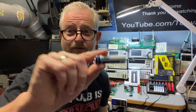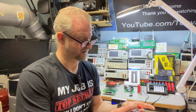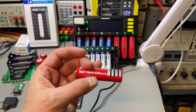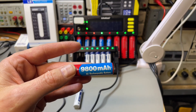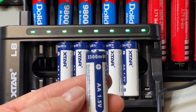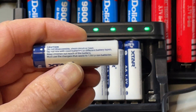I have presumably the worst batteries available — the Dolly Dada. I'm not sure you can even buy them still because it was a big scam. And I have some proper ones that were sent to me by X-Star. These are 3300 milliwatt hours instead of milliamp hours, so we need to see why that is. For the testing, I also have lithium ion 3.7V 4200 milliamp hours, the Dolly Dada alkaline batteries claiming almost 10,000 milliamp hours, and then the X-Stars with more realistic values — but they say 3300 milliwatt hours.